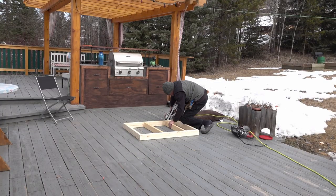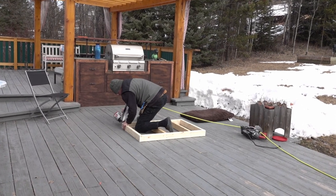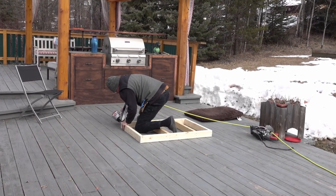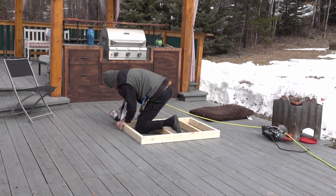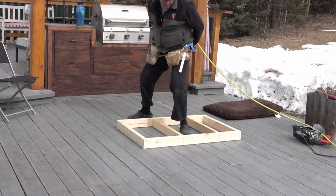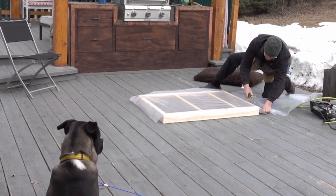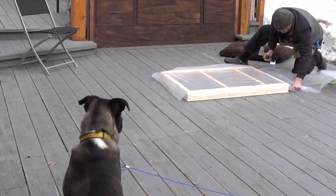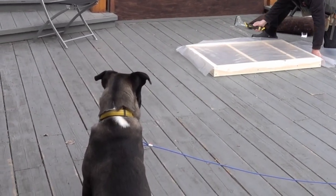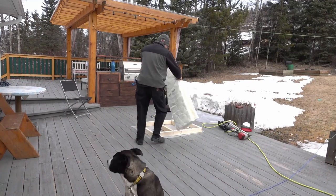I decided to build a standard 2x4 construction shed-style house, well-sealed and insulated from weather, starting with laying out the floor in a 36x42-inch pattern, which is the size of Shamrock's current sleeping pad. The floor will be insulated, so I installed vapor barrier in the form of clear plastic poly to sandwich the R12 fiberglass insulation. Using a hammer stapler makes quick work of attaching the poly.